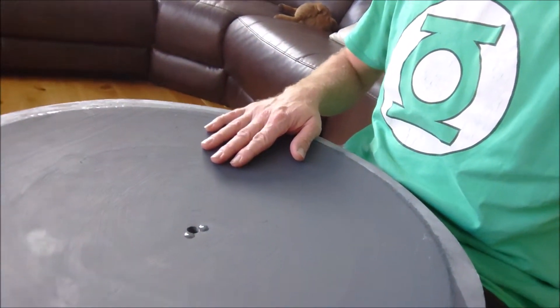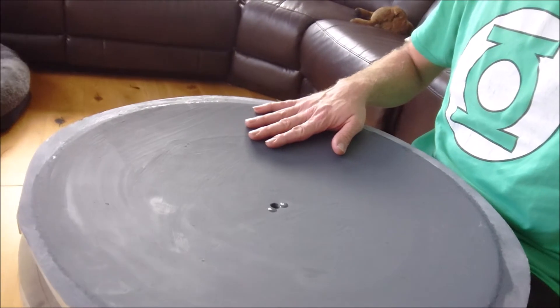So at the minute you're not going to be able to see this, but this is the current state of the mould. I'm going to go through starting off with 240 grit paper and working up to about 1200 grit paper wet and dry, and hopefully we'll have quite a good surface finish at the end of that, which we can then wax and put a release agent on and then start epoxy and carbon fibre. So I'm just going to skip ahead to after the sanding.